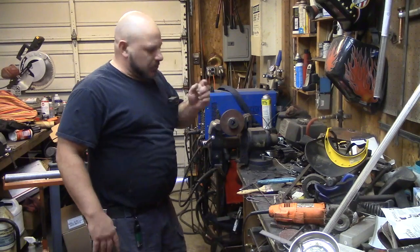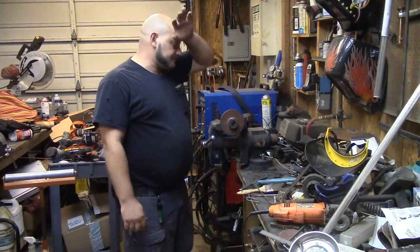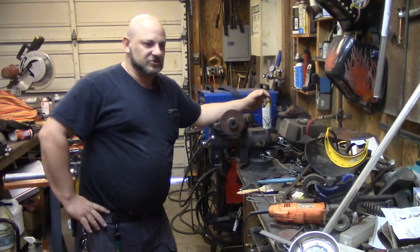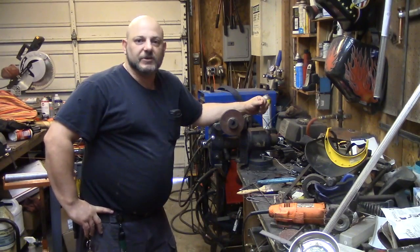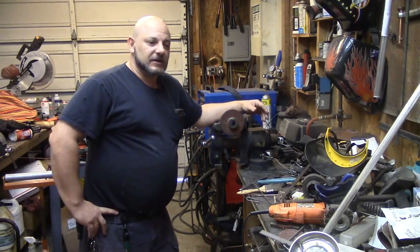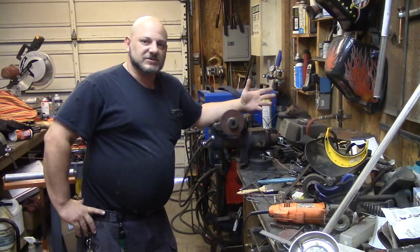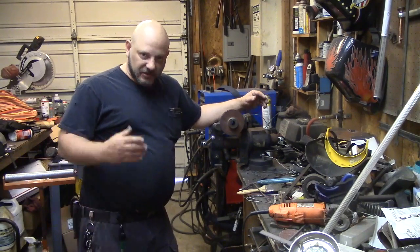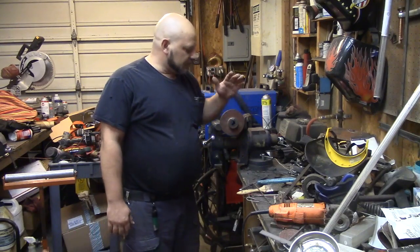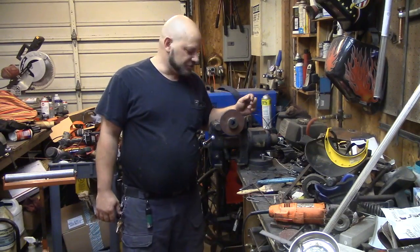When I changed over to a DC motor, I stopped using the original pulley because the first motor I had had such a wide RPM range that I really didn't need the higher speeds. But with the beefier motor on it that turns half as fast, I'm finding that with the mill I do need to get the head up a little faster, so I want to reinstall the original pulley. And it has two issues with it.